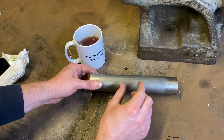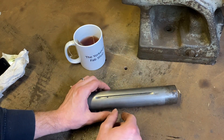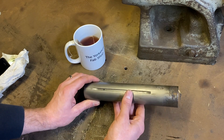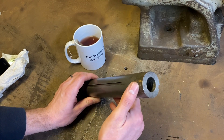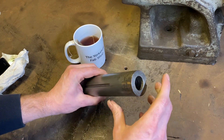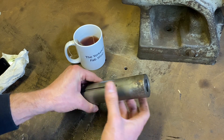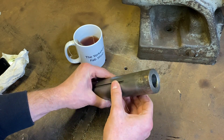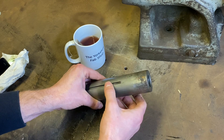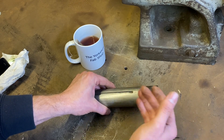There's no slot for drill drifts or any removal, so this has obviously got an auto-ejection feature — it pops the item out when you get to the end because the thread of the screw gets to the end and shoves it out. What that also means is any not-so-well-fitting items like drills with tangs won't have any chance of preventing that initial slip or rotation, because with a slot the tang of the drill will sit in there. They're not designed to drive off, but when you touch onto a material that initial spin is negated by the tang, and then once you get pressure on the drill it drives into the taper and holds itself.